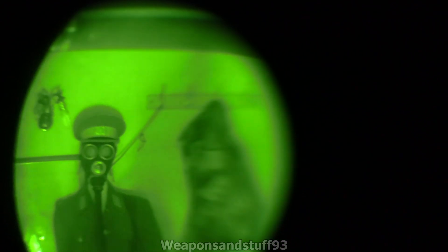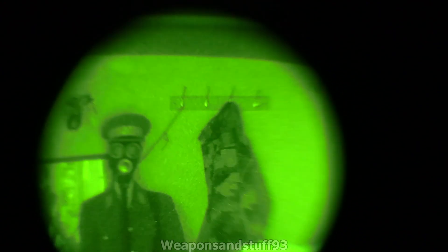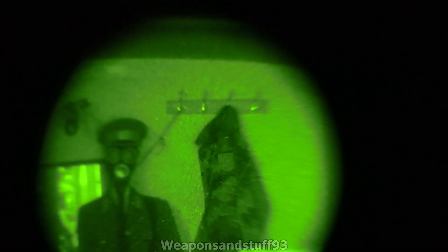Where the Gen 3 might not be as good is seeing different ranges of IR light and its bright source protection — obviously we are not going to test somebody else's night vision with bright source protection. The 850 nanometer IR aimed at the floor — you can see it can definitely detect reflections of IR literally off the carpet, so it's very sensitive to that wavelength. Now let's try the 940 — and this picks up the 940 pretty well. Interestingly, these Russian Gen 3 units have a better IR range than the American ones, because supposedly American Gen 3s have a lot of issues picking up 940 nanometer IR and above. So this Russian one seems alright. The resolution is definitely better on a Gen 3.